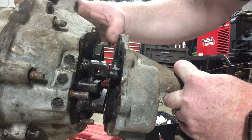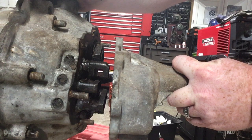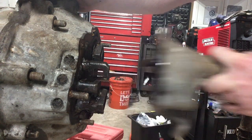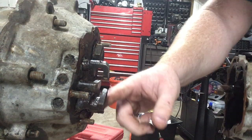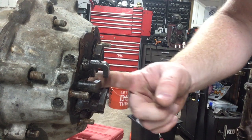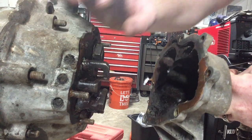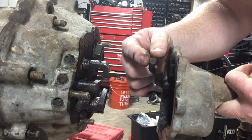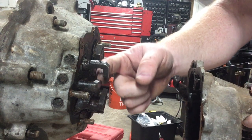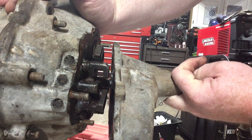Once you clear the studs, the hockey stick is trapped inside, so you have to go sideways to get it off. You can see this transmission isn't in neutral — this one's actually corroded and stuck. When you go to put this back on, this little tab has to go inside this one because it shifted. Ideally it'd be in neutral and all three would line up, but to get this back on I'll put it in the one that shifted.